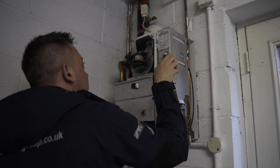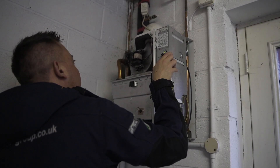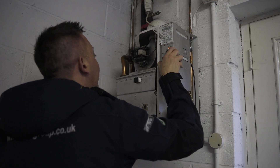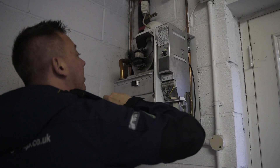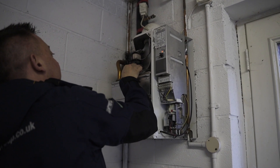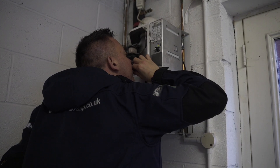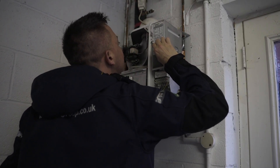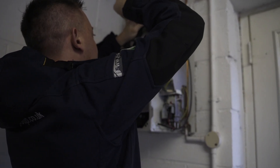Just waiting for the zones to give it a feed. Now it is running quite fast actually, but it's not triggering that air pressure switch, which is probably why it's not firing. So we'll give it a hand. Yeah, that's about the issue, isn't it? I think this air pressure switch is the issue.